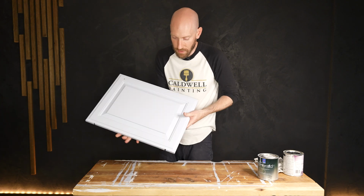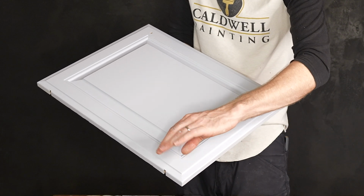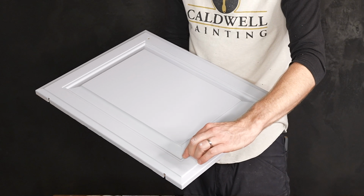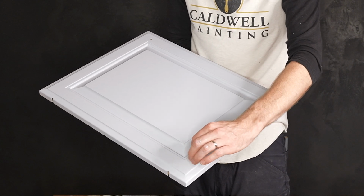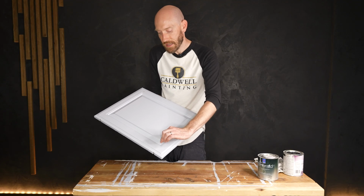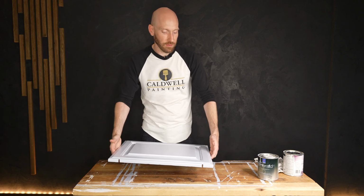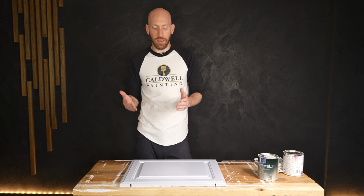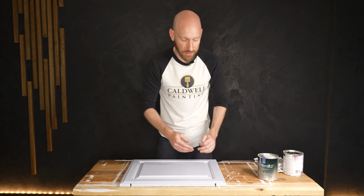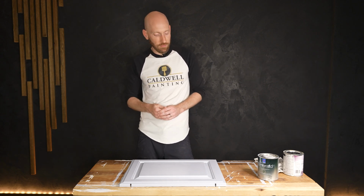One of the things, I don't know if it shows up or not, but the reason I meet my two points of the paint is I like for that overlap mark, that lap mark, to kind of melt together the best that it can. But what you'll see is it's in natural alignment with that joint. So that joint's really always going to be there. And that way it doesn't draw your eye, instead of bringing them across like a square. I like that 45-degree angle and just kind of work with the piece that you have.